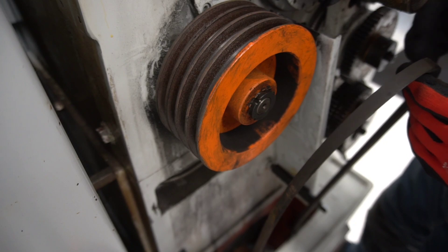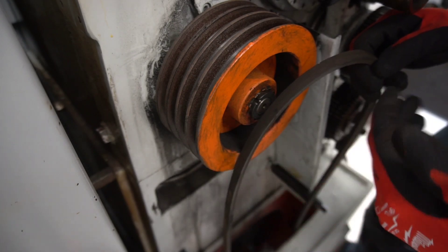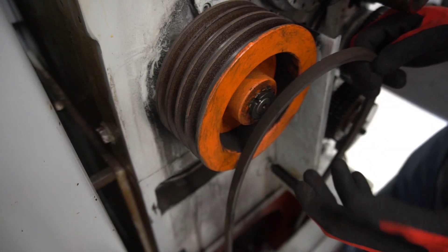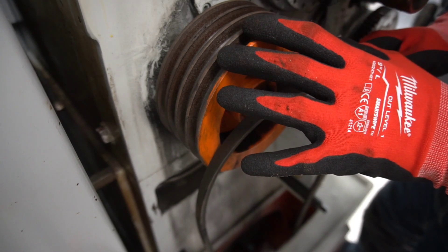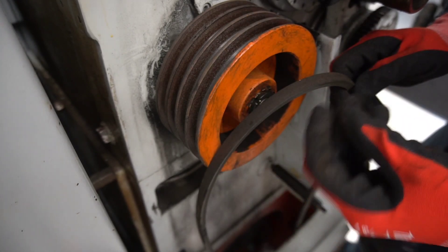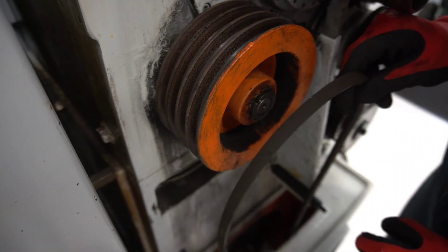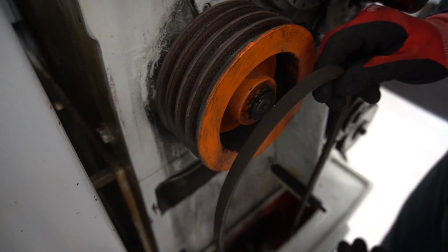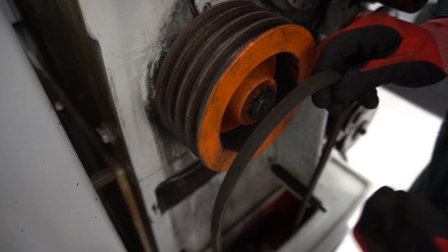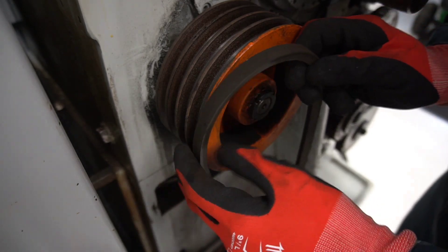When you're doing this, you really need to pay attention to where your fingers are against the belt pulley. Because you often have quite a mass to move, you can easily get your finger stuck and it won't stop — then you can break your finger, or in the worst case it will be cut off. So it's a very good idea to do it yourself and not have a co-worker pulling or moving the belt pulley to help you, because then it's easy to get caught up.